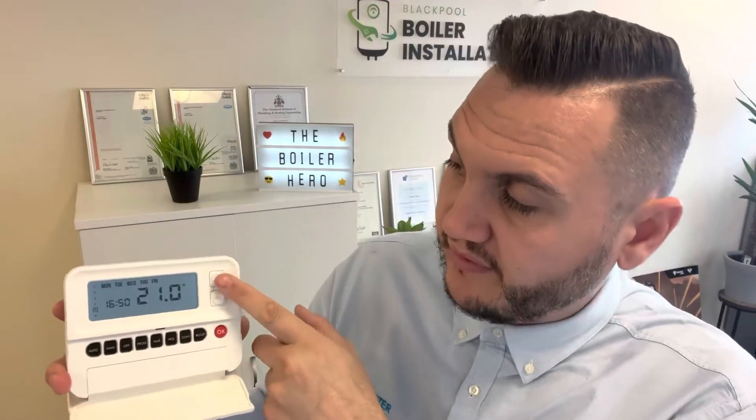The third slot is what time do you get home from work? You might think right, I get home at half past five so I'll put it on at 5 o'clock. You want it a bit warmer tonight so 21 degrees, but you can go up and down — press okay. Then the last one flashes — what time do you want it to go off? Let's say bedtime is 10 o'clock. You want it to go off and in the middle of the night you don't want it to come on until 8 o'clock the next morning, so put it down to 10 degrees. If you didn't want your house to drop that low you could put it up to say 17 or 18 and it will come on as a precaution in the night. But if you want off to mean off, take it down to 10 and press okay.